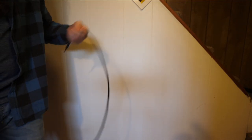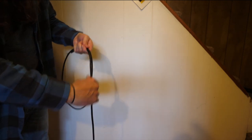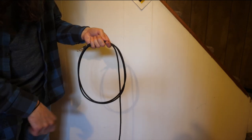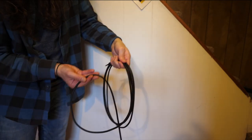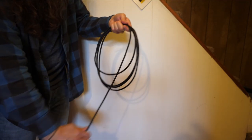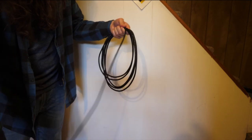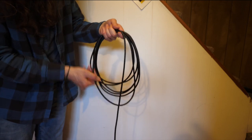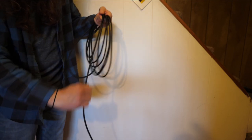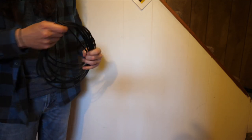Okay, so the right way. We take the cable in our hand, grab about two feet, pull it up in a loop, and then another one — we go under. This is the over-under method: over again, open my wrist, under, closed wrist, over. The more you do this, the cable will retain a memory, and the more memory it has, the easier it'll be to wrap. It'll almost wrap all on its own and you'll have a perfectly wrapped cable every time.